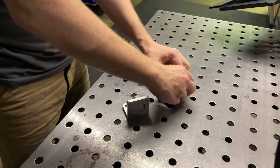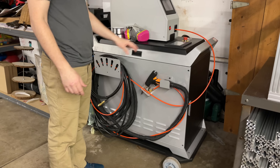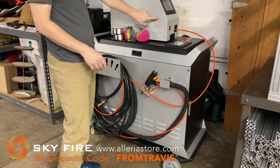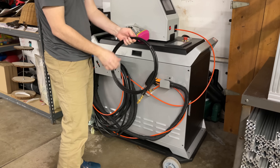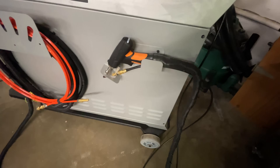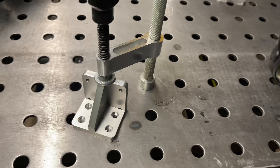All the holes are tapped. These are the two parts that I want to weld together — I made a little groove to make it easy to align this piece and then I'll weld them together like that. If you didn't see my fiber laser welder video — last time I tried to weld aluminum I was having trouble with the wire binding up in the wire feeding machine. Since then I've learned that I should be using thicker wire, which I have now, and there's a special graphite tube that's better for aluminum that helps it slide through. I got the graphite wire feeding tube installed and it seems like it's going to work well. I've got my aluminum spool — it's 1.2 millimeter diameter — and I've got the power cranked to 2,000 watts. I've got my first part clamped up.